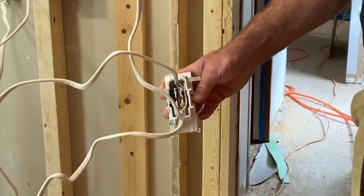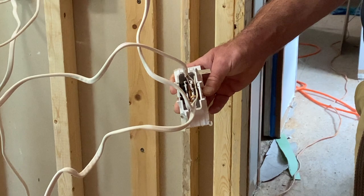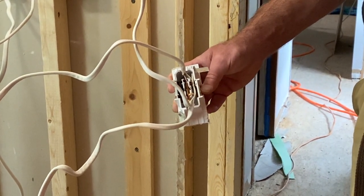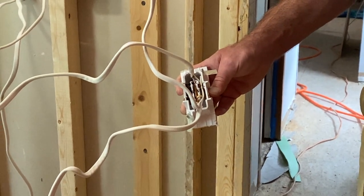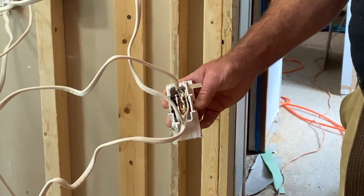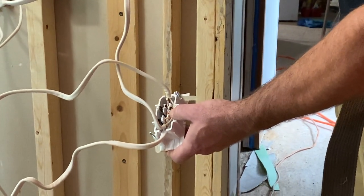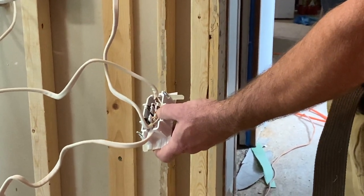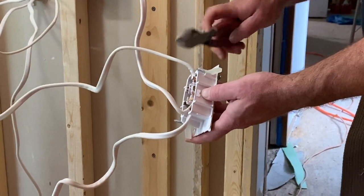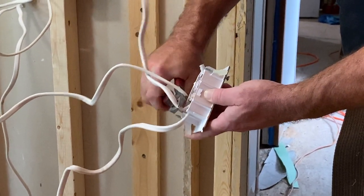These are pretty fancy switch boxes — the wires are actually pushed down in between metal prongs, and it gets really crowded in here when you have multiple wires. I like the old school way of doing this. We've got a single-pole switch, and we're going to be wire-nutting all of the hots and commons together on this one in order to make a solid circuit. We're not really concerned about saving this switch for anything else, so all we've got to do is cut the wires loose rather than trying to pull them free. It's a whole lot faster.